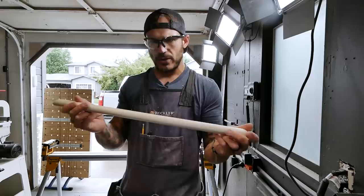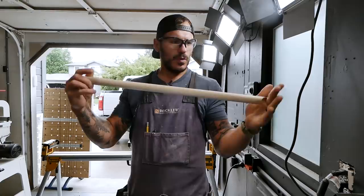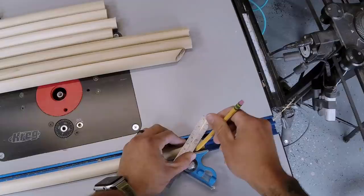I'm trying to set my miters on these dowels. If you place it against the back of the fence and try to create a miter it'll work, but as soon as you rotate it just a little bit, your next miter is going to be off — meaning we won't have a nice parallel section. If we use something to place this in position — it has a little groove so it works just fine — tape it, set it against the wall, create my miter, rotate it, create another miter, and then this section will be done.